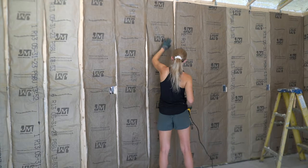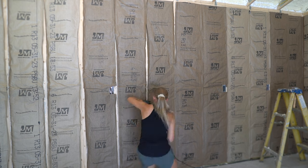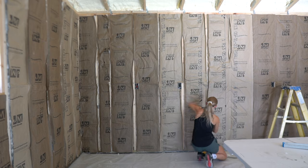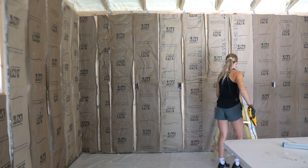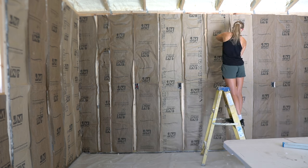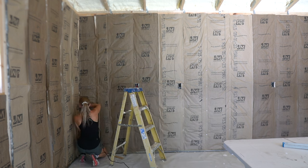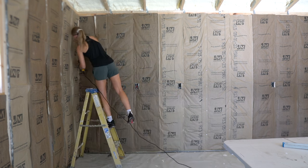Now that all the insulation is in, I'm going back and stapling the tabs of the insulation to the studs every 6 to 8 inches. I made sure to overlap the tabs so that no studs were exposed where possible. I used an electric multi-tacker for this project, which helped it go a lot faster. I'll link that in the description below.